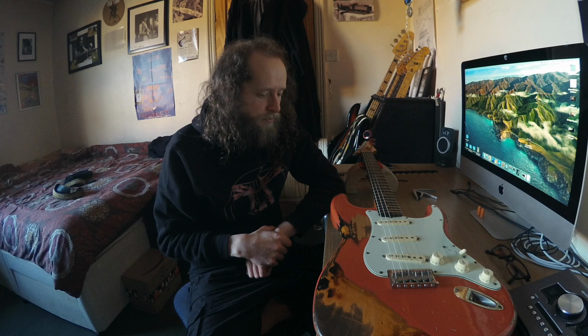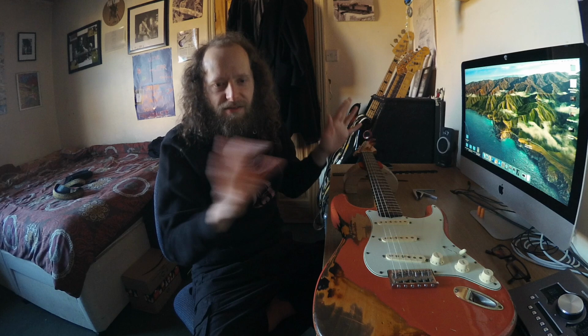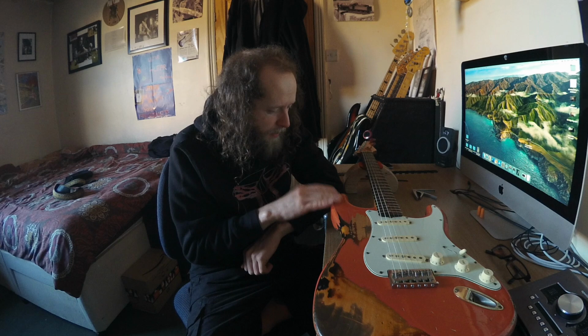The one thing I will say is the neck can be up bowed like this, the neck can be straight, and the neck can go back bow like that. So basically the headstock starts to aim towards the floor. The back bow is what you don't want. That is where the truss rod definitely needs adjustment, in my personal opinion. You don't want back bow, because it humps the neck of the guitar to a point where you just can't play it. It just pings out and sounds naff. So, bear that in mind. Back bow bad. Straight, if you like it, go for it.